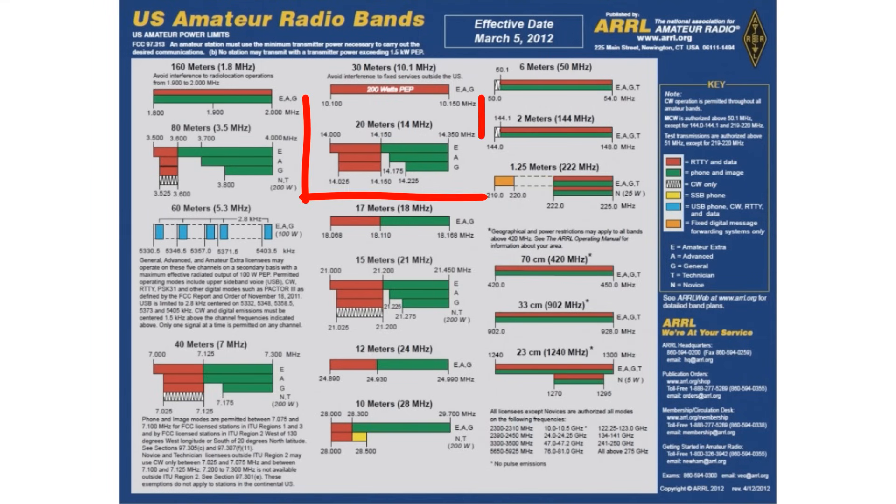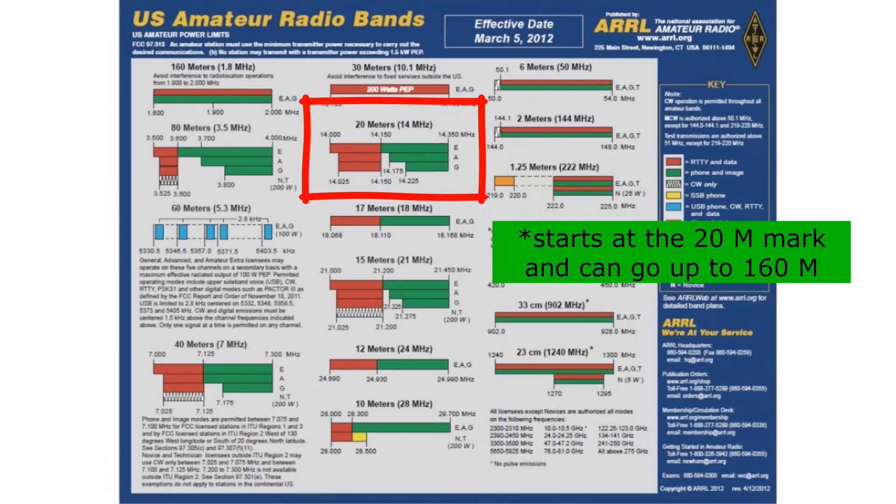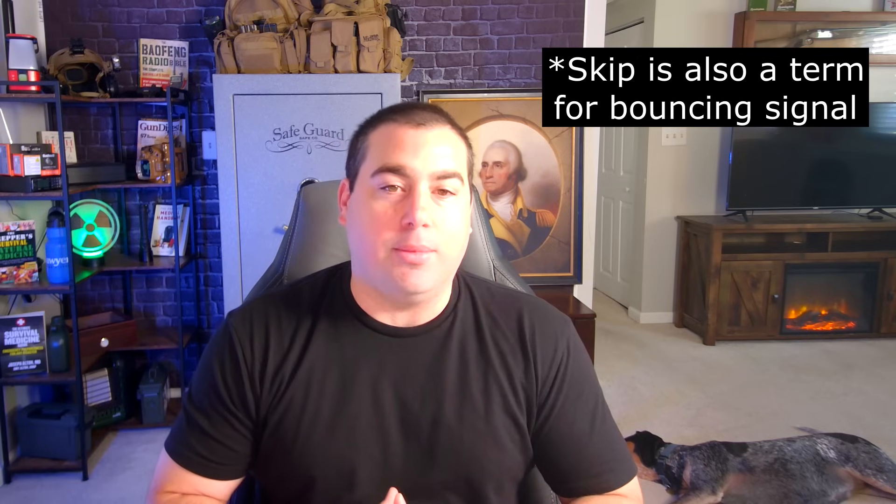I want to very quickly talk about MUF — maximum usable frequency. This has to do with bouncing your radio signal off of the ionosphere. Typically hams will say it's around the 20 meter mark, but that's general and debatable. Right now because of the sun cycle, people are even using the 10 meter band to do this. It's all about conditions — time of day and night and lots of other factors. That's why you hear CB radio users talk about skip and being able to accomplish this. But in my opinion, CB is rather unreliable based on conditions, with its low power and not quite long enough wavelength to accomplish skywave propagation reliably.